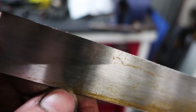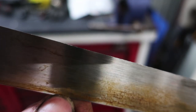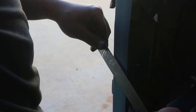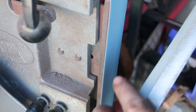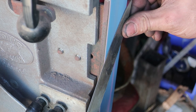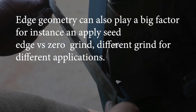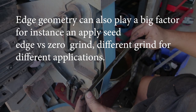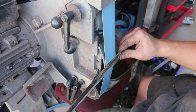The edge geometry I ended up making is a bit thin, so I did end up rolling the smallest amount, but I'd rather take a roll than a chip. The aim is to find a perfect balance point between too hard and too soft. So initially it was chipping, implying it was too hard, but I brought the temper up to the point that it's no longer chipping but neither too soft, that it's deflecting the edge like a ribbon or completely curling the edge over.